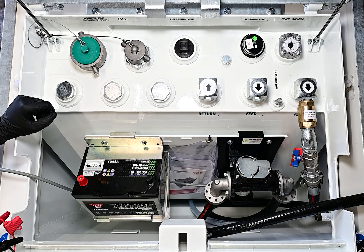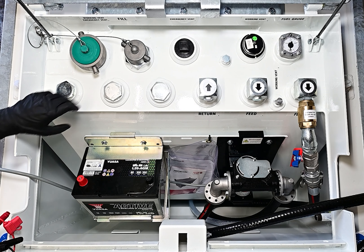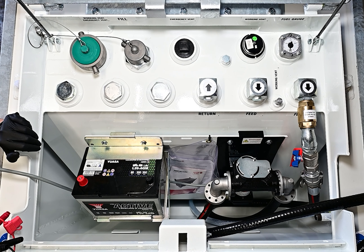The pumps that we provide are self-priming, which means you don't have to worry too much about using it for the first time. However, there are a few tips that you can use to make life easier. First of all, make sure you have the tank full. It helps to have at least 80% full, but we normally recommend that you just fill it up to 95%. That will mean you'll have a fuel level that sits just above the pump and that will help the pump prime itself much faster.